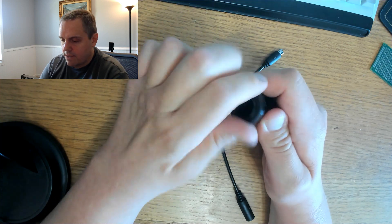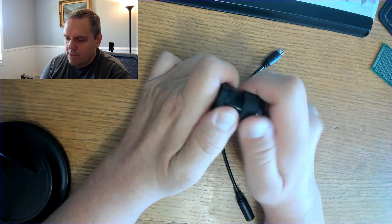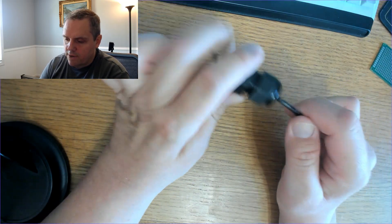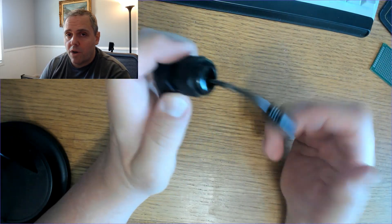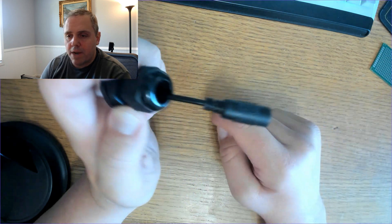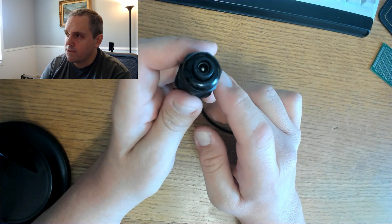Make sure it's snug and then you can see this part shrinks and gets smaller as you twist it tighter. But it doesn't get small enough to accommodate this cord — there's still a lot of room, so there's going to be an opening. We don't want that. So what I'm going to do, I bought some waterproof heat shrink tubing. I'm going to heat shrink this once I connect the power supply, then push that in there and fasten it snugly, and that'll create a seal.